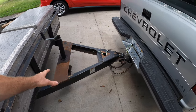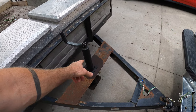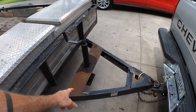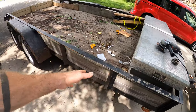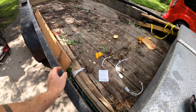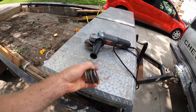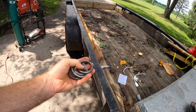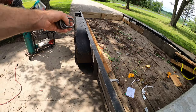The business end of the trailer is kind of what you'd imagine. I did have to move the screw jack back here just so my tailgate can flop down, and I welded a plate in place to hold the screw jack. Mod number one: I've just been using this rail to lash to and it just kind of sucks, so I'm going to put some rings on here. You can get more elaborate weld-on rings for like seven bucks a piece, but these are just some steel rings I had around. I'm going to weld them in place and make some fixed lash points.